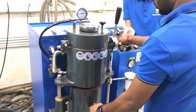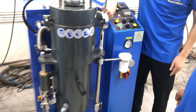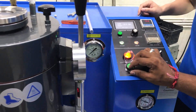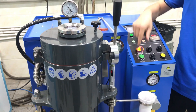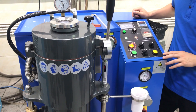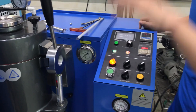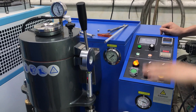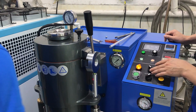Lift the casting lift here. Vacuum pump — check this, check this — vacuum pump to the end. We can start casting. Let's cast. Maybe wait half a minute, then we can start the exhaust. Pressure is ready. This is automatic pressure casting — we set 3 seconds. After casting, 3 seconds of overpressure. Switch off the vacuum pump.